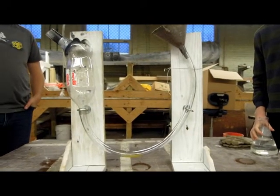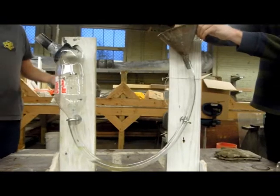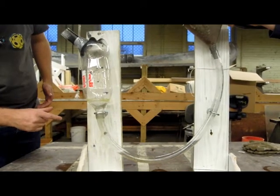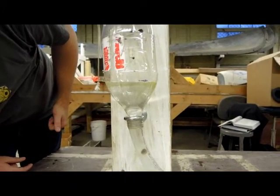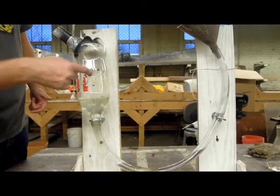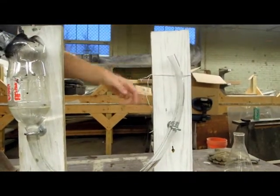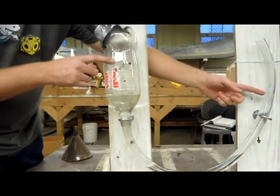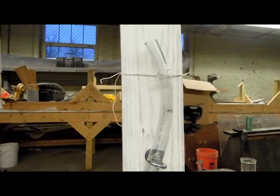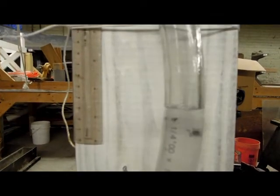Now we are going to begin the final part of our experiment, demonstrating the simple idea of pressure. While pouring water into the system we're actually creating a pressurized vessel — the manometer. We're going to have the water up to a certain point in the bottle, and just by blowing into the bottle from one side you can see that the force of the air pressurizing the vessel will actually push the water, and on the other side of the plastic tube you'll see the water rising depending on how much pressure is provided. Tim will demonstrate by blowing into the bottle, and by blowing slowly into the manometer you can see a constant change of about three to five inches going up and down.